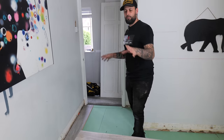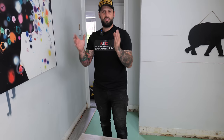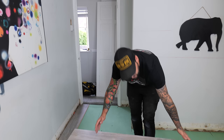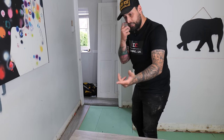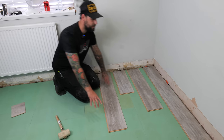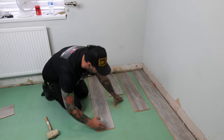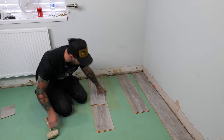For the first three to four rows we're going to cut pieces that are around 12 inches different in size - one this size, one this size, one that size - because we need a random stagger. The offcuts from the other end will start going at the beginning to give you a random staggered pattern, which is what's recommended. Always make sure at least four rows are not close together on the joints.